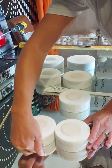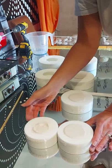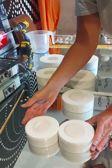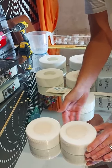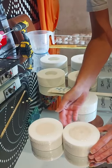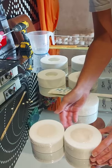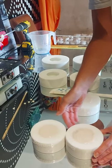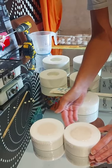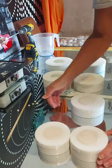What I do recommend is every time you use your moulds, before each and every pour, is to wash with some warm soapy water after you've done a pour and you've removed the casting from the mould. There can be a plastery residue left inside, or bits from the plaster. So yeah, a good rinse with warm soapy water before each and every mould. Just make sure that they are clean.